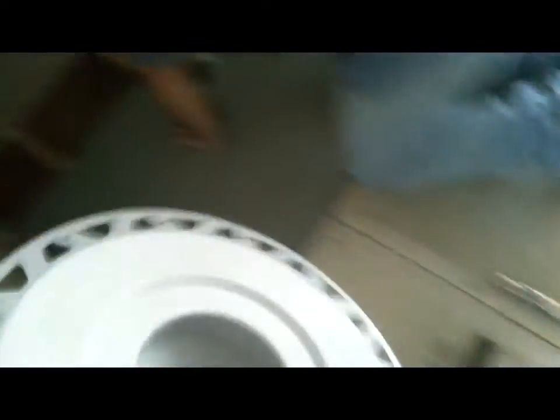We've put the Durock cement board up on the walls and brought it right down to the floor joists. You can see where we've taken the subfloor all the way out. We've cut the drain pipe to the right height. This is the TI Pro Board now on the floor — it's a fiberglass material, a little bit flexible without thinset. The next piece has a hole cut in it and a little lip on the end that clips over and locks into place. We've got our drain hole lined up, then we take our Schluter drain and it goes right down inside that hole, locking onto the pipe. We'll glue that in place and we'll be all set.